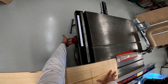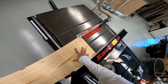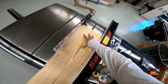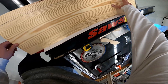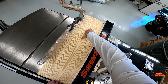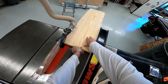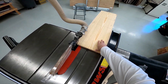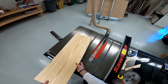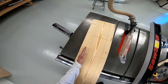We're going to pull the red paddle. We're going to focus here — that's where our eyes are going to be. Good down pressure, good pressure against the fence. My eyes are looking right along the edge of that fence, making sure things are nice and square. Now I'm out of reach, so I do fingers, thumb, fingers, thumb — keeping that board tight against the fence, flat against the table. That was the first cut. This one didn't actually cut because the board was narrow enough. So we're ready for rip cut number two.